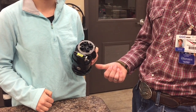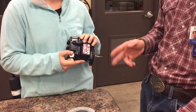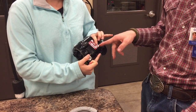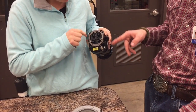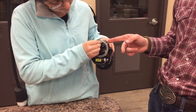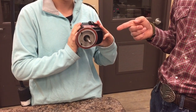This is a Slick 4309 magneto. The first step for timing the magneto to the engine is to check the internal timing. To do so, insert the timing pin. First we need to figure out the direction of rotation — we check the data plate, and this one has a little L, which indicates it's left rotating. So we put the timing pin into the hole on the magneto labeled L. If needed, you can rotate the rotor shaft to get it to fit in all the way.